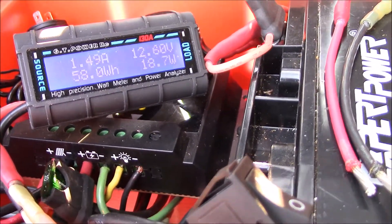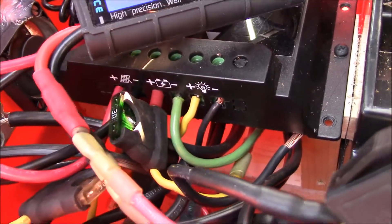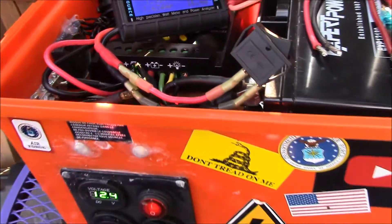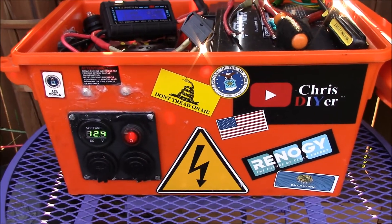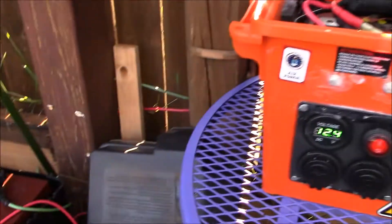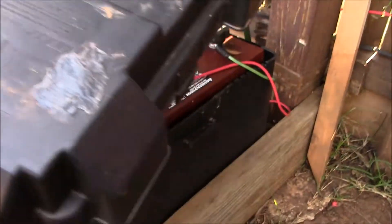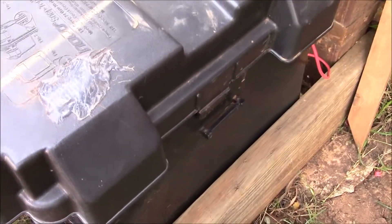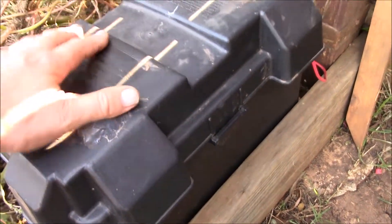Tinned those ends going into the solar charger, and I'm also using a 30 amp ATC fuse for the battery. That switch right there is for my solar panel so I can do maintenance without having to disconnect wires up there — just turn the switch off. It's an AGM battery, it's not a gas battery. I've got vents in there too just for added safety.